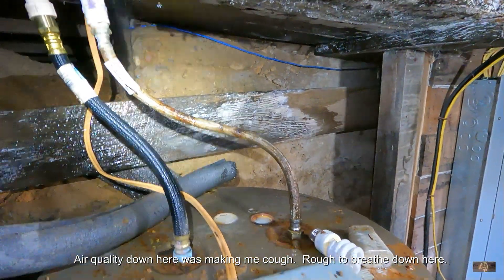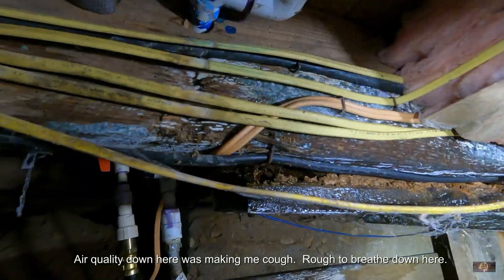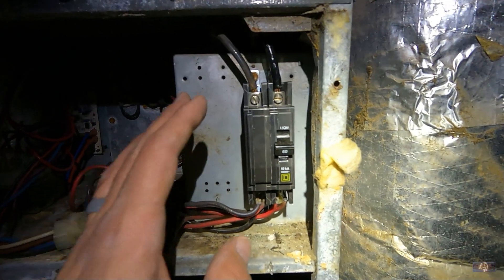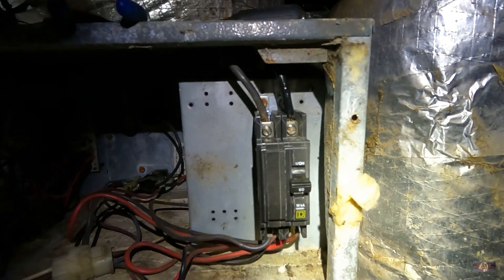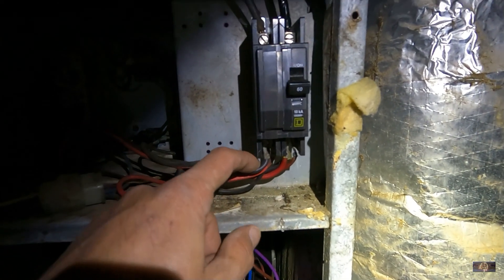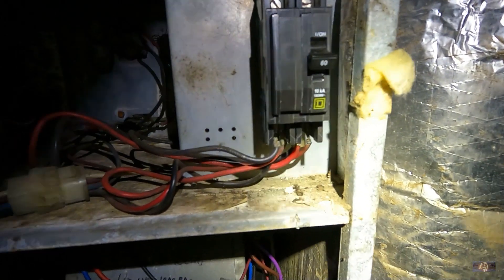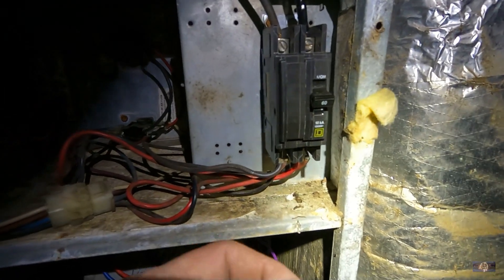There's an active leak down here — it's not only at the bottom of the unit, it's coming down from the pipes. You can see it's PVC. He's actually got plumbers scheduled to come out and re-plumb this thing. You can hear it spraying. That's rotting that support completely out — that's not good. I got the inline breaker in, got the wires off up top, got them secured, got the black tape on the white to mark it as a hot. When I took these off, I went ahead and pinched the stacons with my needle-nose pliers so I know they're tight. Whenever I pull stacons off, I like to give them a little crimp with my needle-nose to make sure they're tight — a loose connection is going to be a burnt connection, especially on high voltage. I crimped each one, made sure they slid on nice and tight, and gave them a little tug test.